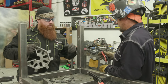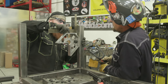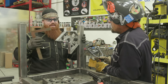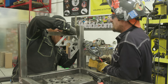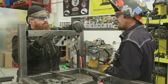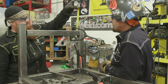Yeah, buddy. We're gonna set these up again for the intermediates. So simple as this, I'm gonna set it up just like that. I'm gonna take my square, put it up on top, and I'm gonna measure down. I want 2 inches. Actually, I'm gonna go 4 because I want 2 inches from here to the bottom of that square too. Remember, this table's upside down. So I'm gonna set this up here and I'm gonna drop down to 4. Good clamper there, Mike. Now I get one of my cross members. Clamp that right there, sir. And now I'm exactly 2 inches below where I wanted to be.